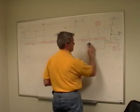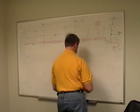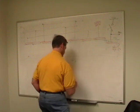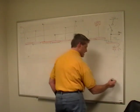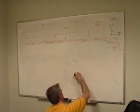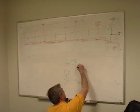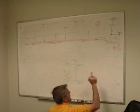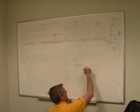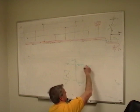And then I closed this gate the same way that we've been doing over here, and all of those electrons have gone there. And what I see at V out, let me see. This is time, and this level here is VDD. So who knows where it is here? We don't know where, but then I do a reset and my voltage goes to here. And now I reset on, reset off, and when I do that, I have leakage, I have electron injection into the gates, I have a few things that cause my level to go off a little bit.